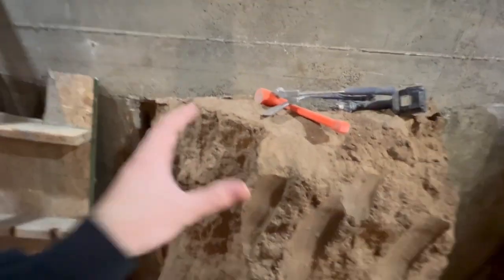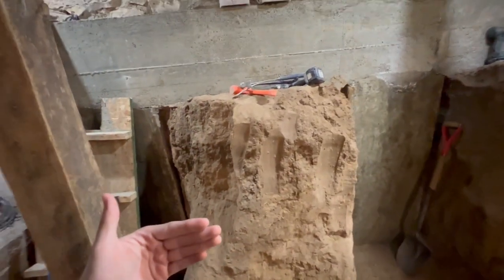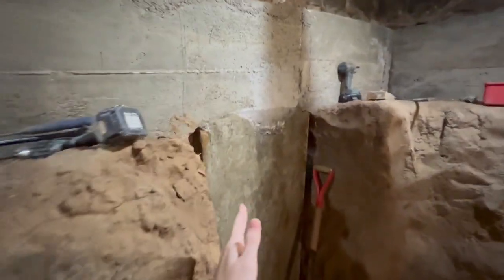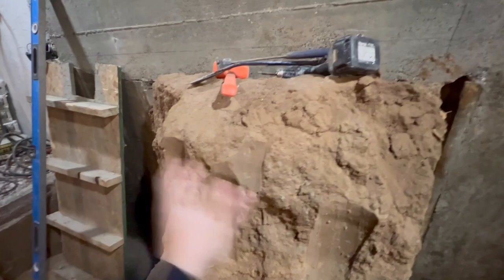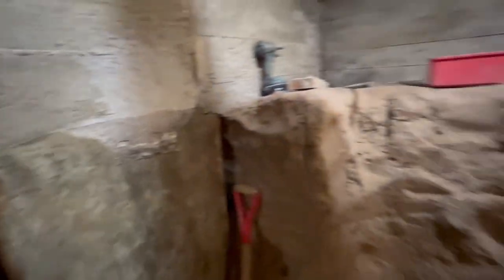This is what I was talking about last week — making sure that the foundation is stable. You can see the dirt is kicked out this way and the previous footer is resting on it. These are cured now and they're going to be holding up the structure. When they're nice and hardened, you come in and get rid of these and the structure remains stable — versus if you just tore it all out, everything would cave in. There's an order to doing it; very important.